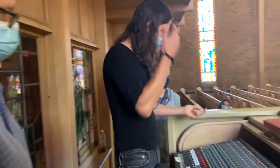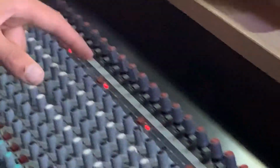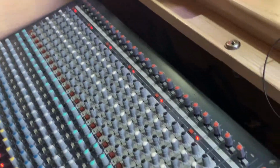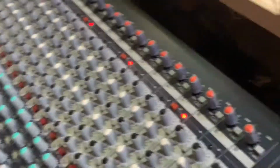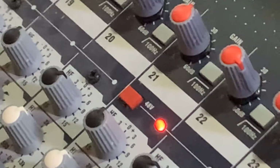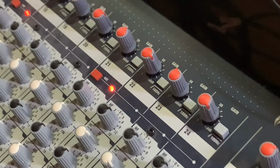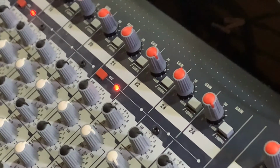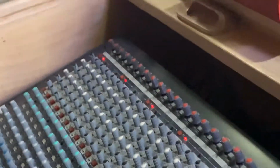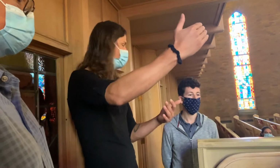Cool. So then the next thing, and you can see that they did this in banks of 4. So 1 through 4 has a button, 5 through 8 has a button, 9 through 12 has a button. That's why they drew these lines. 48 volts, whenever you see a 48V like that, that is what we call phantom power. A phantom power button is for direct boxes and condenser microphones, sometimes guitar pre's, just anything that needs electricity from the microphone cable itself.